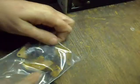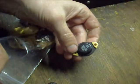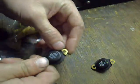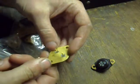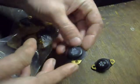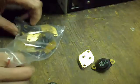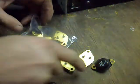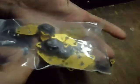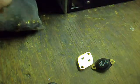And these are the transistors that it used originally in the shunt regulator portion. 2N1530s Motorola and TR346s. They're rated for a pretty respectable dissipation, but the maximum operating temperature is relatively low because they're germanium, so I thought it best to take those out of the circuit and put in modern silicon transistors that can better stand the heat. As I said, there's a lot of them in there. I can use these on some other project. They're all in good shape, but not for a project that requires high temperature, that's for sure.